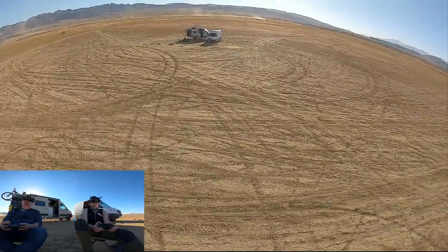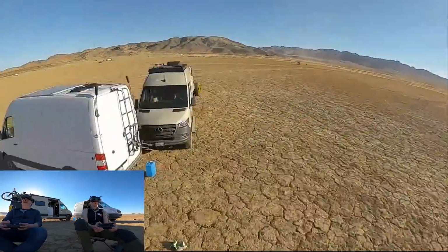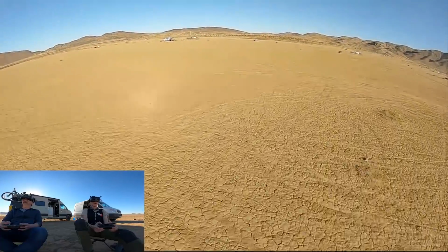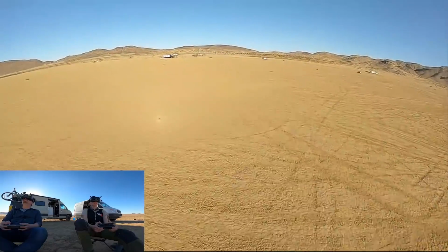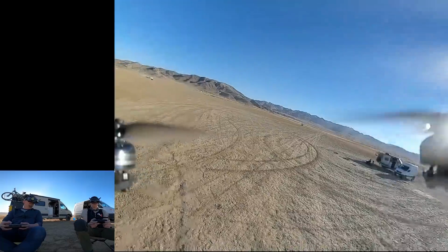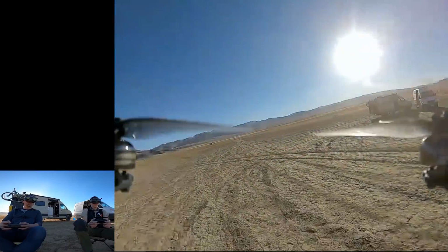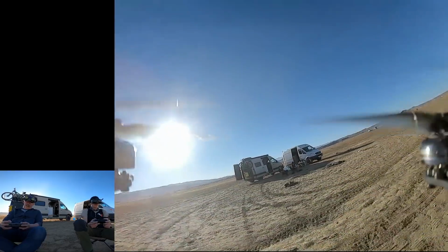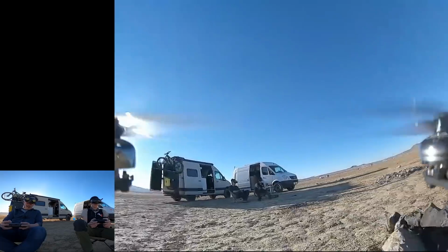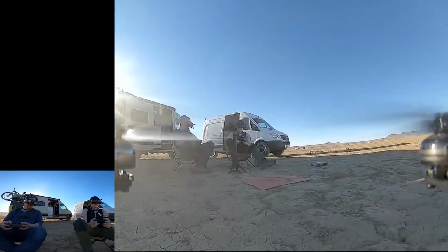Our OSDs are calibrated for lithium polymer. Yeah, and they'll go red at about 13.8, 13.9, and they'll start blinking at us, which is totally wrong for these. You're going slow, though. I'm still at 50% throttle. Oh, 12.0, okay. Yeah, that's it. When you see 12.0 for the first time, that's when it's done. I am going to at least get to the landing pad.